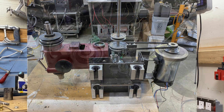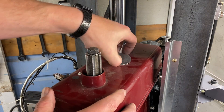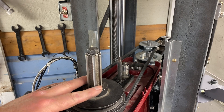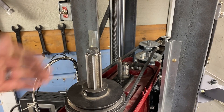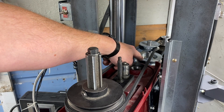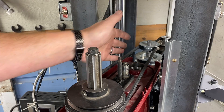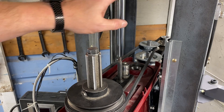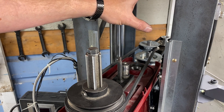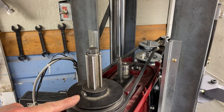So let's take a peek behind the curtain. This is my current configuration. This is the mill head spindle that moves up and down as I move the quill. This pulley goes to a smaller pulley in the back, and then we have a bigger pulley on the bottom that ultimately connects way back there to the drive pulley on the treadmill motor. This two-belt system allows me to utilize the RPMs of the treadmill motor — the motor is good for about 4,500 RPMs — and by gearing it down, I was getting between 200 and 1,200 RPMs at the spindle, measured from that magnet right there, so we know that's accurate.